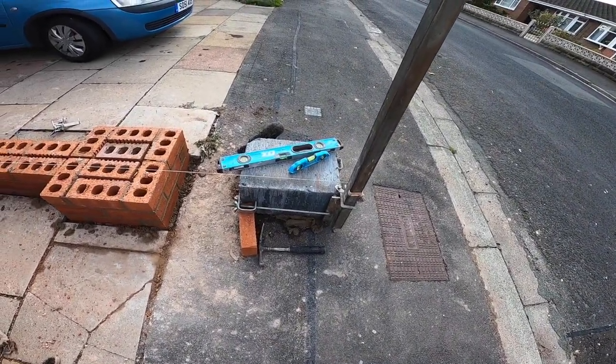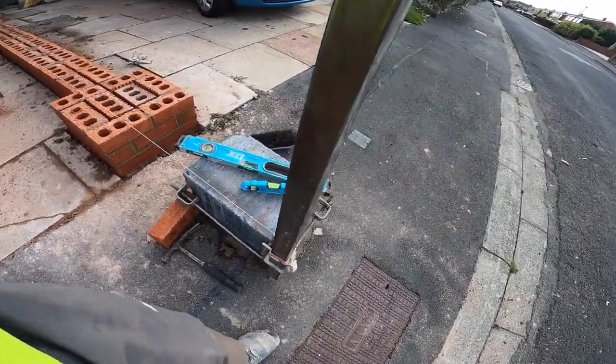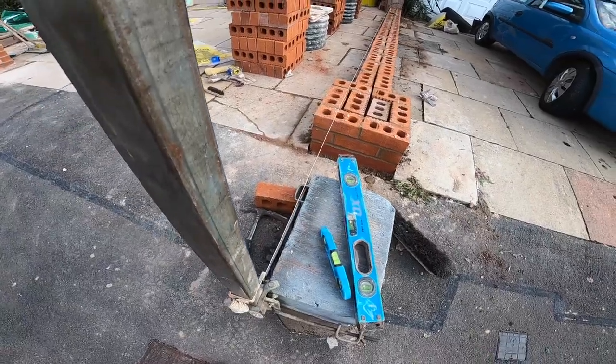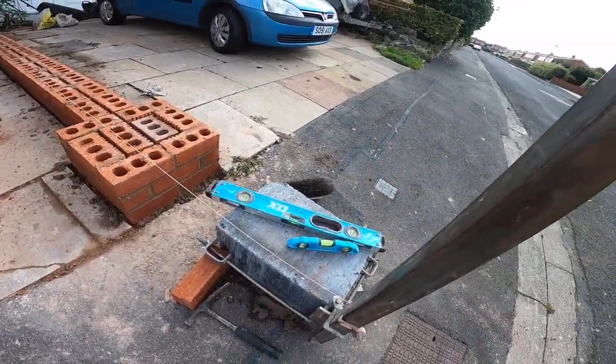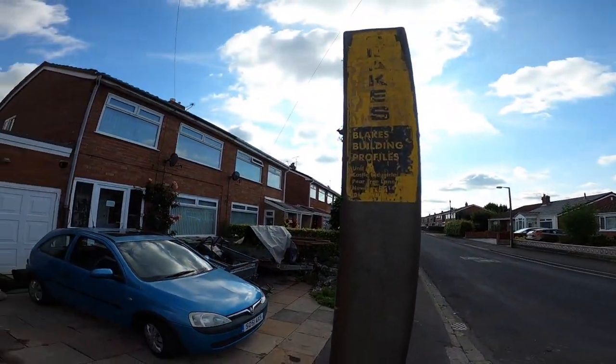There's a quick one in our instant corner setup, trench block. I know it's bedded on the tarmac, but that will be cleaned up after when we're done. Get your first 3 courses on the block, and while you get them 3 on, the block's gone off, and whack the blocks on.